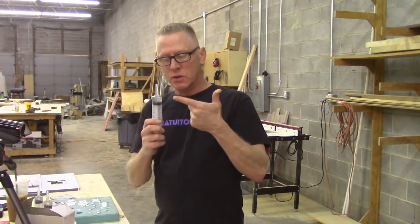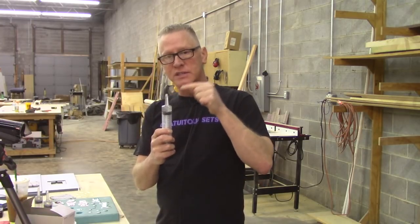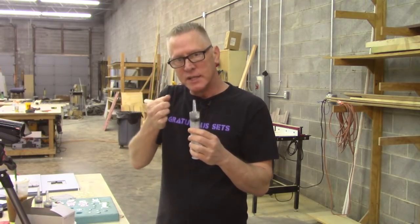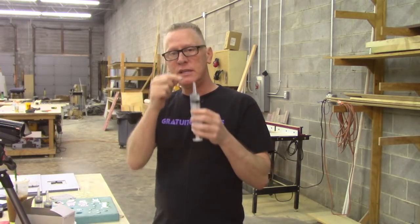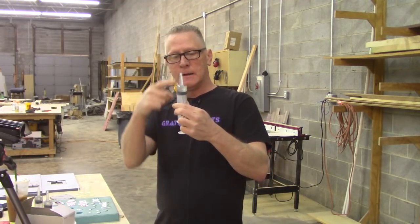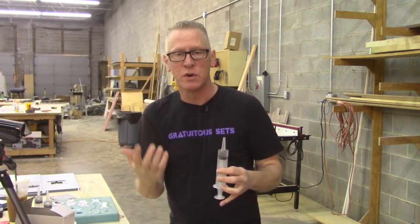So my goal in doing this is I am making a casting of the inside of the nozzle. And so when I use this as my sprue and I go to use one of these syringes to inject the resin in, what I'll have is the wall thickness of tension, pressure, friction holding down on the nozzle. So I'll know that I'll get a good seal. If I simply just drill the hole in it, then if it was a cylinder, it's only the narrowest part or the widest part touching that cylinder that would actually make a seal. And that's not good enough, because you'd blow out the resin. It would just get all over your hand and that wouldn't work. So this taper, and being able to match that taper, but stepping it down a tiny bit, is what gives us a good pressure-worthy injection head.